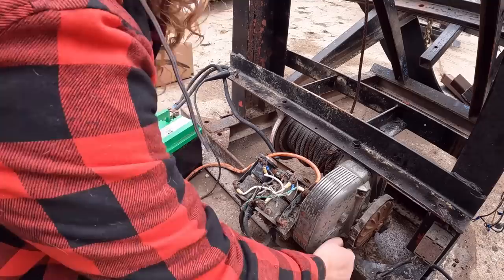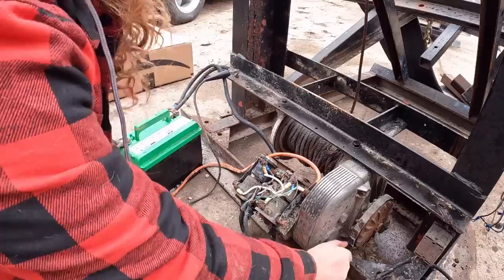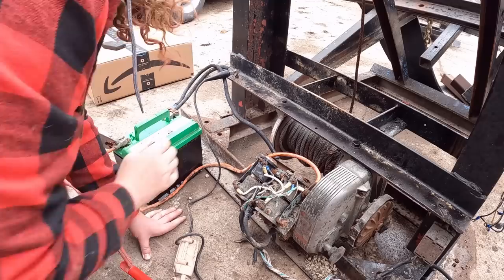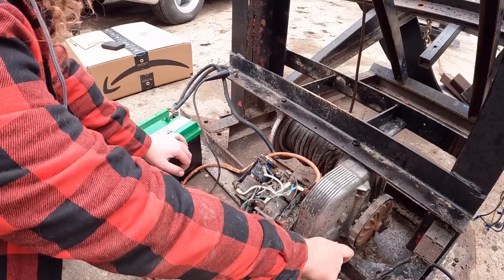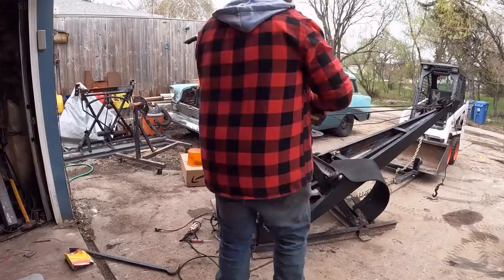We'll try to jumper the winch. That didn't do anything. The freewheel is completely seized. I did a little bit of looking around - a new motor is $200, the freewheel is $100, then we've got to cable it, so it rapidly becomes expensive to fix this thing. Princess Auto has a sale on winches so that might be the end of it for the original winch. It's not seized mechanically so it does move and the lock works, but by the time you get a remote, rewire it, cable it, with a motor and freewheel we're talking real money.